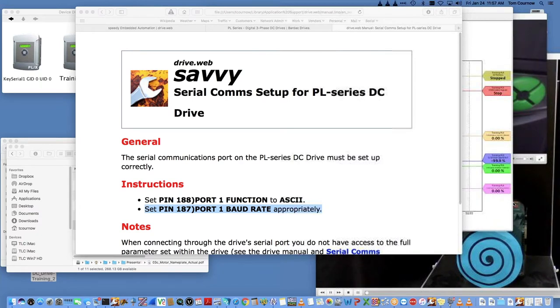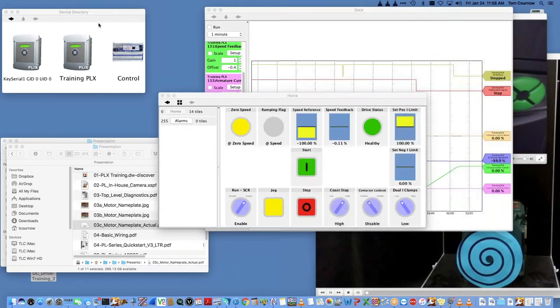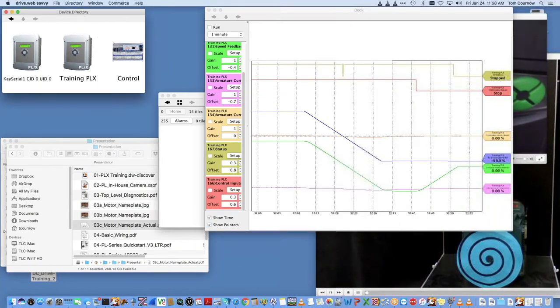Any questions before I move on? A question came up about swapping A and not-A, or B and not-B. You only have A and B — whether it's both A and B positive, or A and B inverted. You just need to swap the B and the A and that'll change the sign for you. If you've got all four channels on an AC drive, you can swap A and not-A for B and not-B. But always swap them, check them, and make sure the sign is correct before you throw it into feedback — whether it's AC or DC.